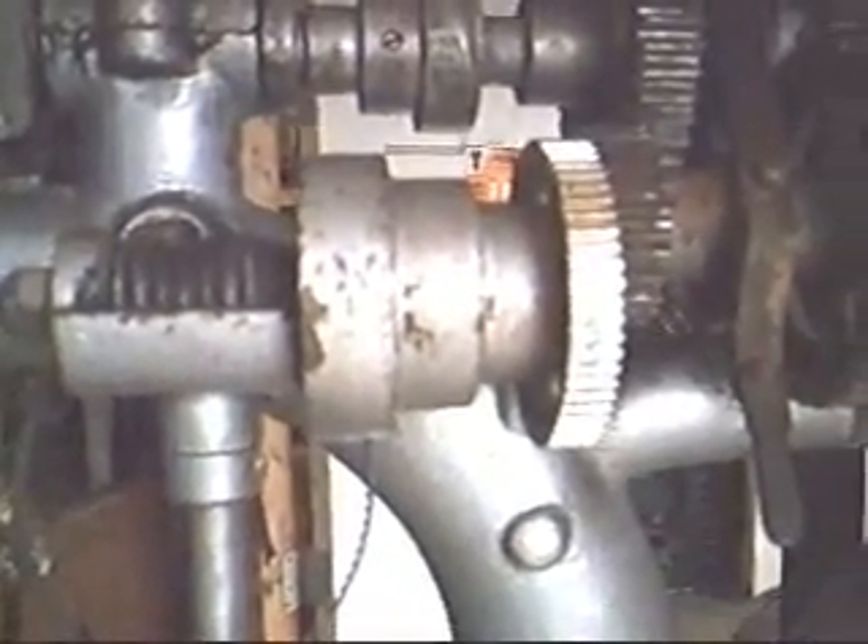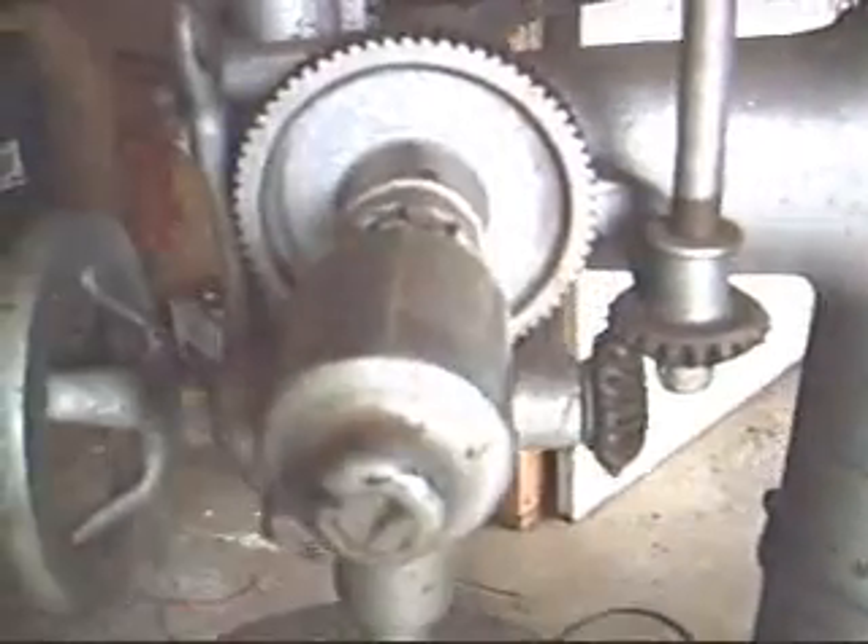So it gives it about another four to one reduction. I'm planning on putting that synchronous motor — it's a stepper motor, magnetic coils in it — on this right here to drive the down feed. I have a switch for down and a switch for up. The neat thing about that motor is if you stall it out, it doesn't do any harm, it won't overheat or anything.